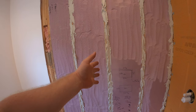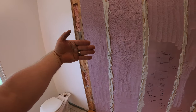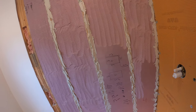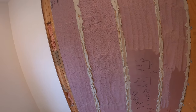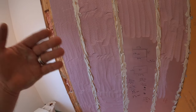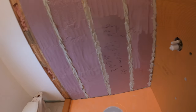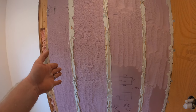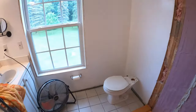Here's the wall put up to be floated out. On an interior wall without foam you can just scrape against the two-by-four and get a nice triangle all the way down. We know our center is the furthest point in, so we don't need anything there — we just want to become straight. We know where our low spots are and put a little more thinset there. I'm mildly concerned but not really that it might bow out toward me, but I think it's going to work out. We'll get both boards up, cut the notch for the corner, and then gently work from the seam to level everything.